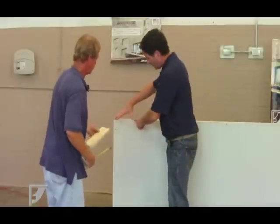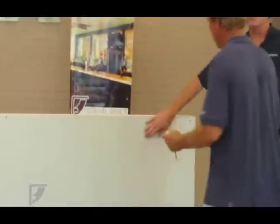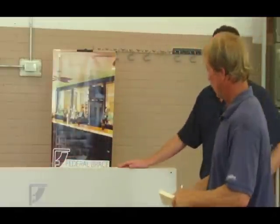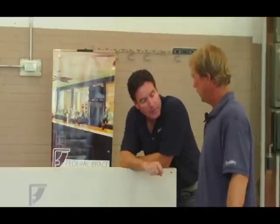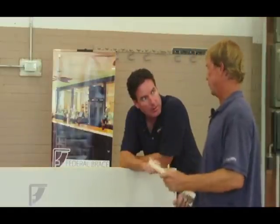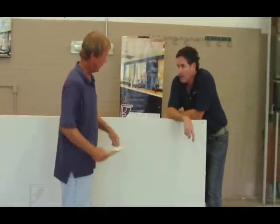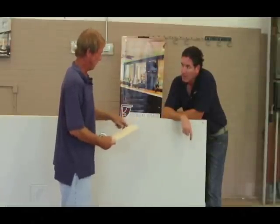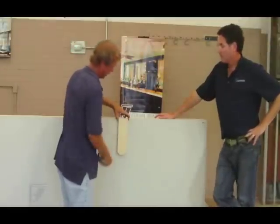How far off the end? We have four of them, so about five inches off the end. You can also consider what kind of facades you have — if it wasn't drywall, it could be beaded board or whatever you want. As long as you put the solid blocking back behind it, it could be paneling or beaded board — same thing. You wouldn't necessarily need these backing brackets if it was wood, because the only reason you use these is that sheetrock can actually crush when you tighten against it.